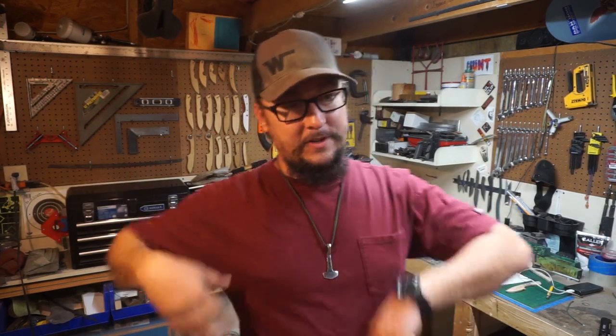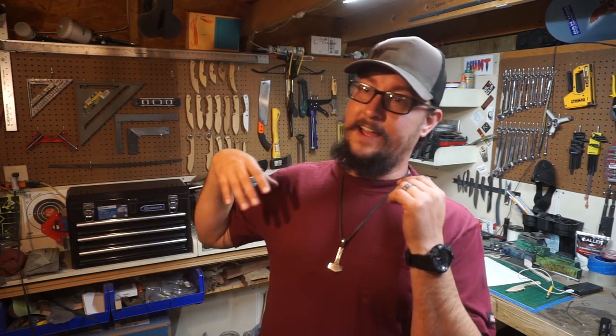Let's say you decide, I've been working with 1080 for a while, I've got good processes with this heat treat, I'm going to jump into 1095, I'm going to do the same exact process, and I'm going to have a great blade. You're going to be wrong. 1095 is not a very forgiving steel. A lot of people try and tell people that, hey, start working with 1095, it's going to be great. Nope.